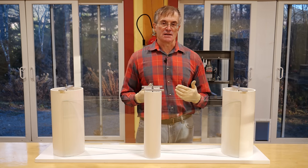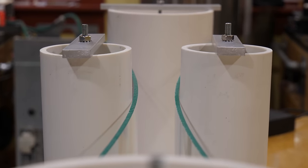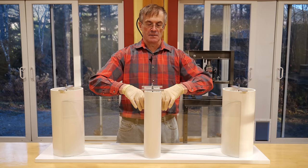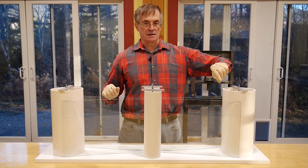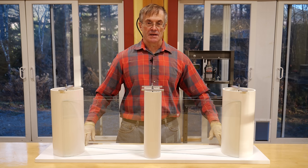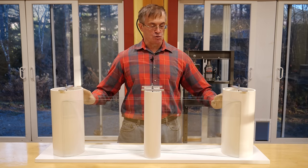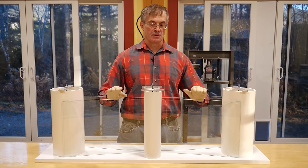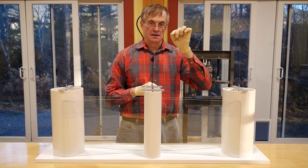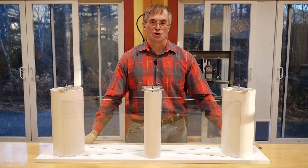But if you can use curved surfaces, you could potentially make the tank a lot cheaper, a lot lighter, and actually kind of interesting in terms of its shape. Using this stressed panel type of design, I took two pieces of very thin — I think it's four or five millimeter plexiglass — cut it and then put them on this rack that compresses the surface in the middle to give you a nice even curve. Then I'll pour in some epoxy into the bottom, forming about a one or one and a half centimeter thick bottom, which forms the bottom surface without having to cut a complex piece of plexiglass, seals the surface, and provides the bonding that keeps everything together. If this works and gives me a nice surface without a lot of flexure, the idea is to produce a tank that is effectively four sides like this on all surfaces, with the corner joints coupled together using that epoxy technique — a clear joint without needing these pipes, giving a very lightweight tank with a very unusual shape. Hopefully it doesn't leak.